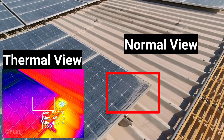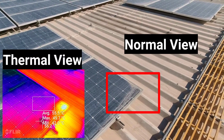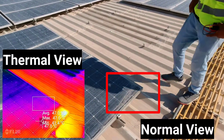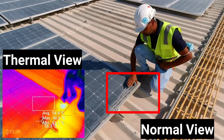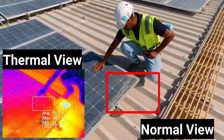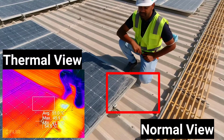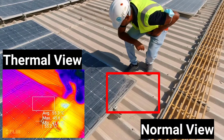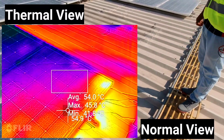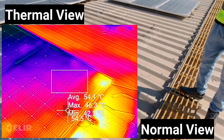I will test it manually with Mr. Kuljit. Kuljit, come here — you should go to the corner. It is very warm. Now touch the other module — there is a lot of temperature difference. You can see in the thermal image, the temperature is so much that the hand is not able to keep it there, whereas the normal module is comfortable to touch. The temperature difference is very clear from the thermal image. You will not see the temperature difference with the naked eye, but if you test it with a thermal camera, you will see the difference just because of this dust patch.